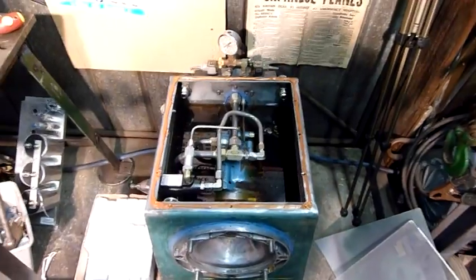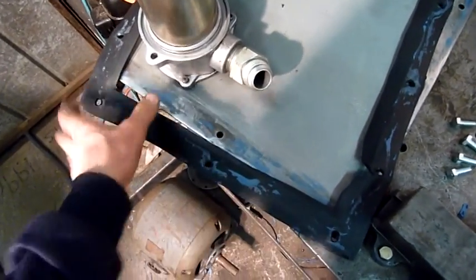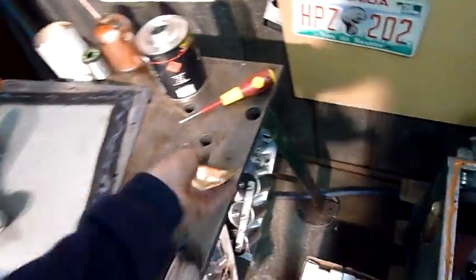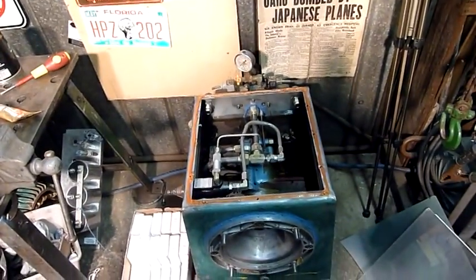Okay, well it's time to close up the casing — everything seems to work alright. I've turned it over by hand and you do get fluid coming out of the return, no problem. Air's bled out of the system and I've cleaned as much as I can off the lid. I'll probably give the lid a little bit more of a rub down — it seems to have freed up since I've wiped it down with solvent. There's a bit of blue max still left on there but I'm just going to use a bit more copper max. And definitely not going to forget to connect the return.